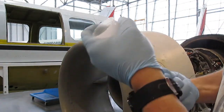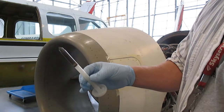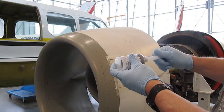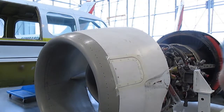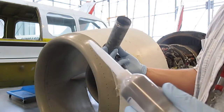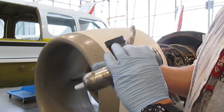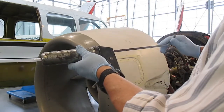Look at that — it's nice and consistent, looks pretty good. I'm going to take it out by going counterclockwise — one, two, three — it pops up pretty easy. The tip is all really nice and gooey, done its thing. Directly into the garbage with the mixing tip. Now I put my application tip on, screw it all the way in, get my gun. Pull the gun all the way back, place my cartridge in — the tip hangs up just enough that it works. Screw it back in and make sure it's correctly oriented.